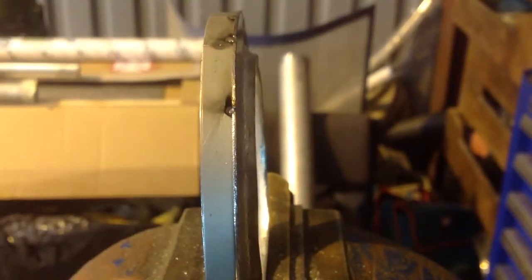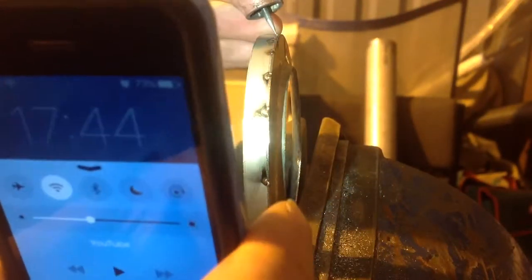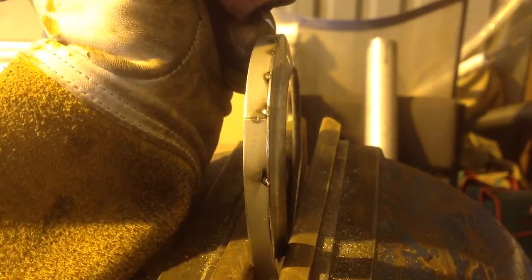What I'm going to try and do now, I'm going to get the light in here to show you, is try and come in really nice and close and just melt that little edge down. Keeping a tight arc, no more than the thickness of this 30 thou material here. And that should form a little fusion weld, because I've just left myself a 32nd there to melt down onto this. I'm not going for full penetration, I'm not shielding the back of this. I need to make this fairly quickly and just get it done. I'm just trying to find a way to get comfortable — I can work my way around there without my hands getting too hot. Using my left hand so you can see, but it still might work.